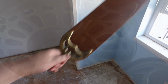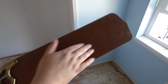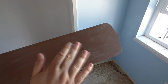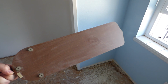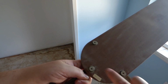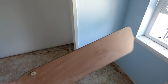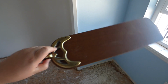Alright, so here's a fun fact. We got these paddles off here, you can whack people with them. And one thing I like to point out is usually on these fans, if you've never noticed this before, you've got one side like this, and the other side is dusty. Besides the dust here, there's usually a different color. So one side could be this brown color, and one can be oak. You usually don't have to take them off with these screws that mount onto the base, but you have to take these 3 screws off here, and there's a rubber grommet in these, and just flip them over and put the screws back through. Number 2 Phillips. And you have a different style to your fan or room, whatever. Anyways, maybe that's not that kind of a fact, but you can reverse a lot of them.